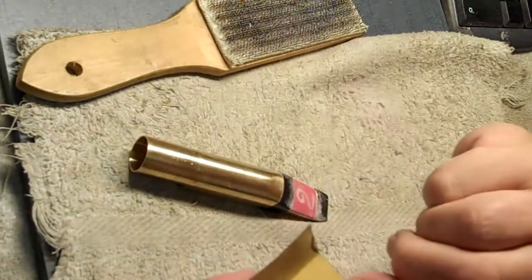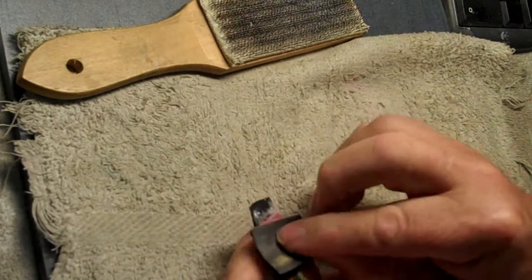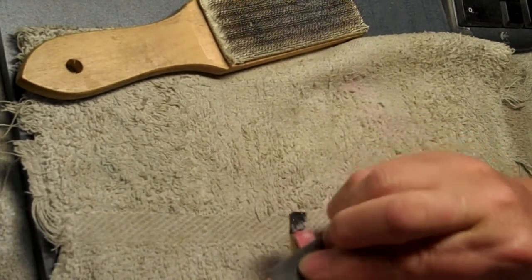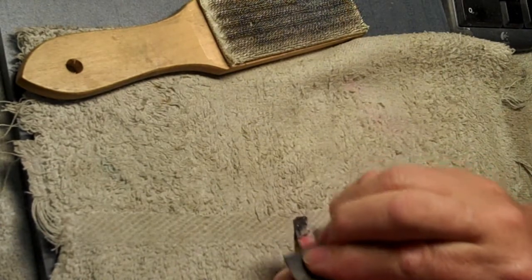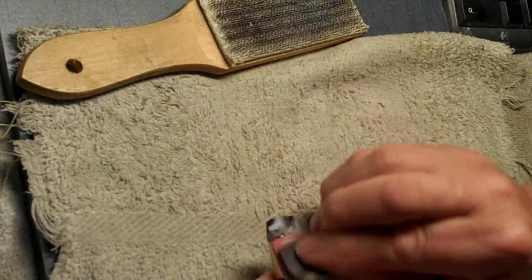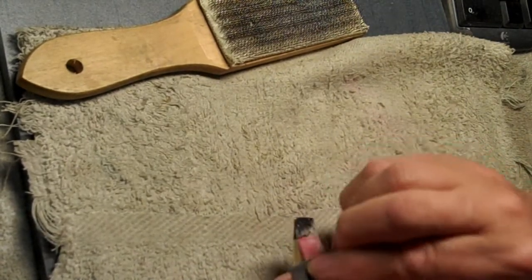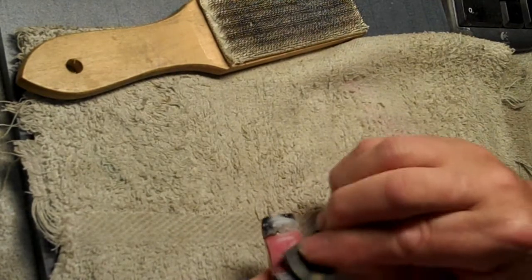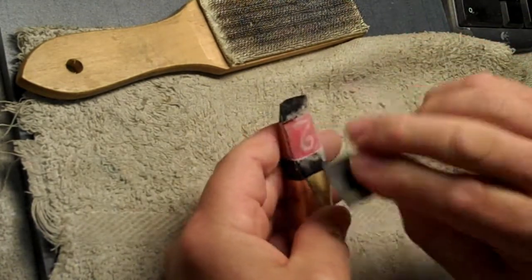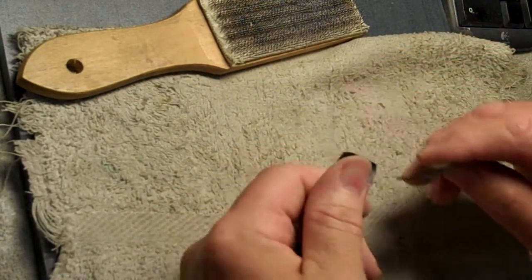After the 320 I'll do a little bit of 400 — this is an older piece but it's still got some grit on it. I'll start going in circular motions too, which helps get out straight lines. Since I have to touch this one up I probably would not go into this much detail since I'll have to repeat those steps, but for the purpose of the video I'm going to keep going. So that's the 400.